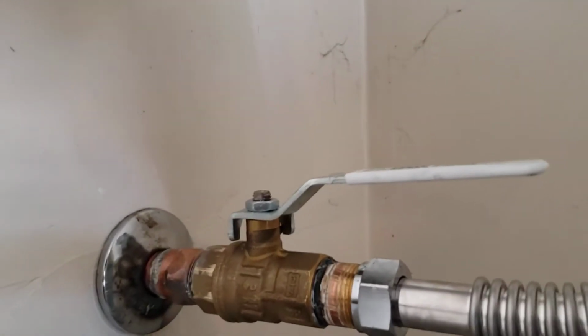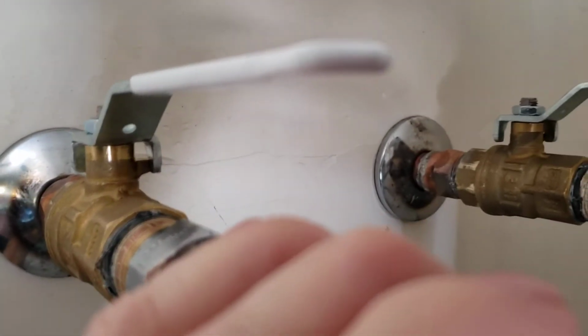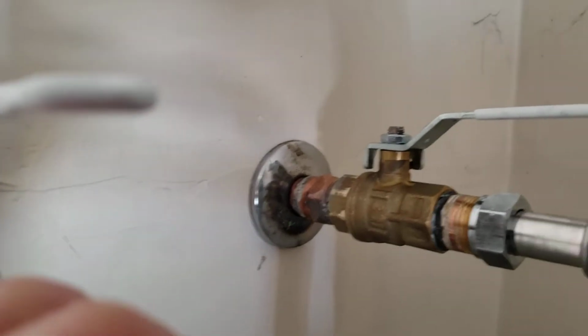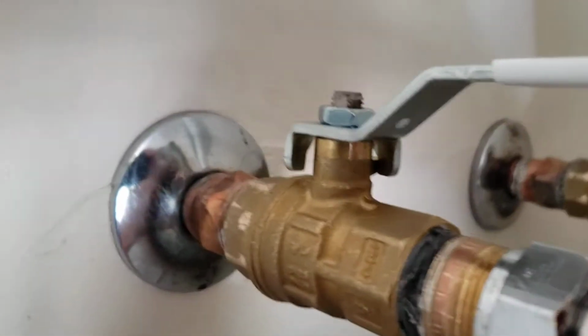Anyway, starting at the top of the water heater, we gave you new shutoff valves. Only one is required on the cold side. Hot's not required, but a lot of times we'll put a second one on just so we can shut the waters down and get the water back onto the home and not worry about water bleeding out the hot side. So 2 new valves. You have copper plumbing in the home, which is great.